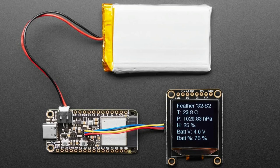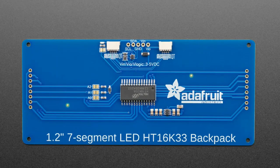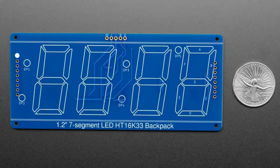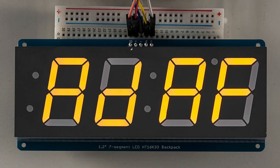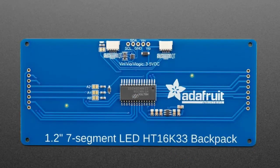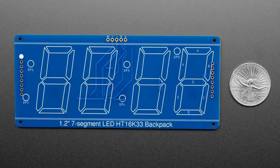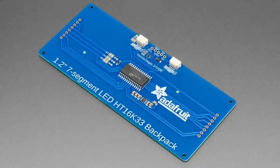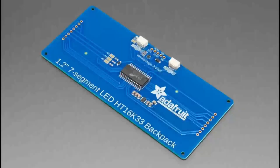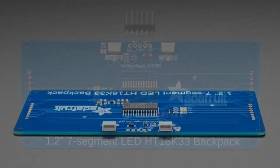We've also revised these chunky 1.2 inch high-letter seven-segment displays. They have a HT16K33 LED driver as a backpack. One thing I did is they now have a little boost converter on the back, because these LED segments have two LEDs in a row, so you can't really use less than five volts - if you don't you're not going to get the LEDs to light up very nicely. Now these have a little booster on the back so you can use them with three or five volts. They'll boost the LED driver to five volts but give you three-volt logic level shifted on the I2C pins, so it's just safe to use with whatever and the LEDs will look good no matter what.